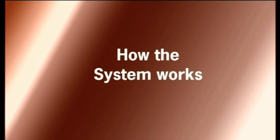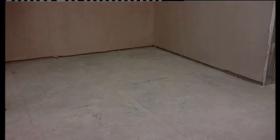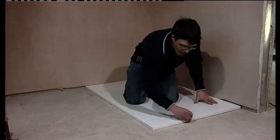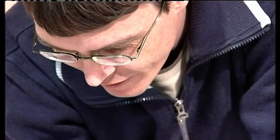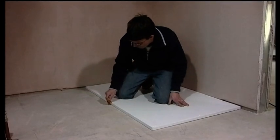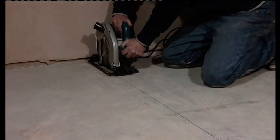This installation you're about to see is typical of a timber floor. The working area will need to be clean and free from dirt and dust in order to work efficiently. Once you have determined in which corner of the room you wish the Aqua Deck to be installed, you can place it in position and carefully mark around the outside. After clearly marking this area, the Aqua Deck is then put to one side, and you carefully cut along the line you've drawn.